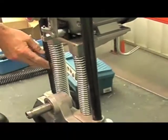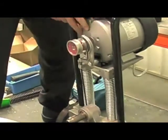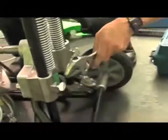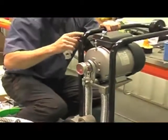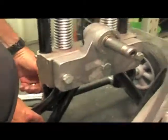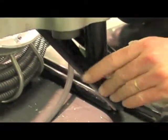At times, if it's in dusty conditions, you'll have to lubricate it. These are obviously springs — you can put CRC or Inox on the springs, just so when you're pushing it down it's nice and free. While we're on this section, always be careful with your loading bar. At the back of the machine there's two little wing nuts. Always make sure they are nipped up once you've got your right height. This stops, if you load something, the loading bar coming down and hitting on the switch cover there. There are also two little bolts that go on the bottom in here, which stop the loading bar from coming out on you if they were loose — so the loading bar cannot come out of your hand and away from the machine.